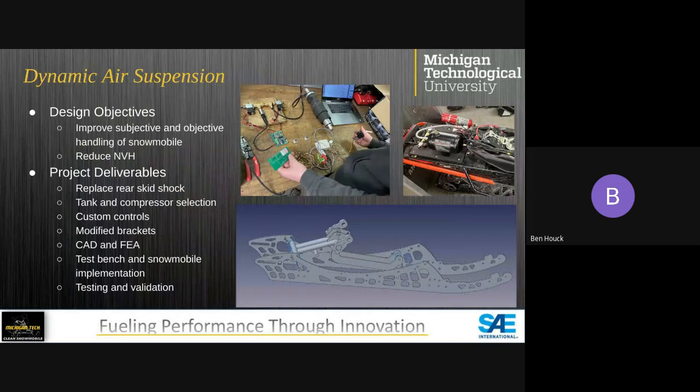That's our goal going into this, and what we thought we could improve by implementing air suspension. The project deliverables, there are quite a few of them, but the first one was replacing the rear skid shock, so replacing the stock shock with the airbag that was graciously sponsored by RideTech. We also had deliverables to find a tank and a compressor. You can see in that picture our tank and compressor mounted on the tunnel of the Yamaha Viper. We did quite a bit of research to find the best compressor and tank setup that would be good for our application.